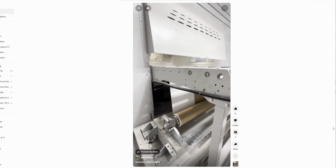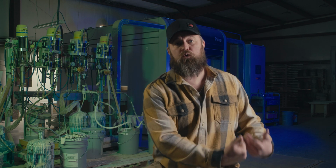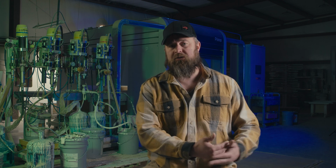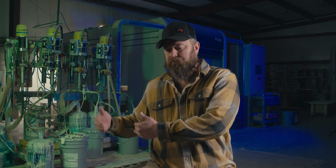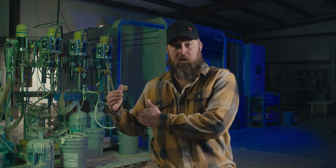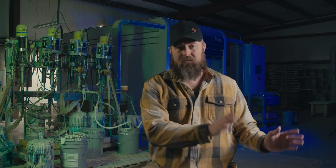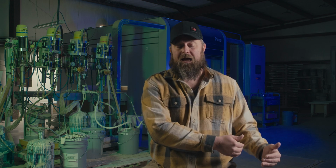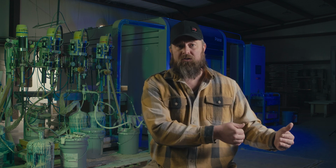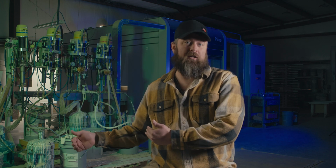However, your volume of parts going through the machine scales to such a degree that it no longer, in my mind, becomes about how much paint am I losing, because it is important to be efficient with your paint loss. You want to be efficient, but it becomes how fast am I getting parts through to where I can bill out the customer. So if you take those two kitchens a week, let's just say they were $10,000 kitchens for easy math, that's $20,000 a week at 50 gallons a week, versus now I can bill out $100,000 a week, and I might use 500 gallons.